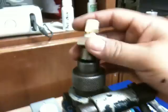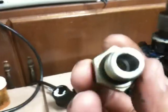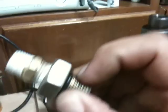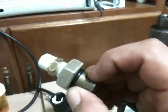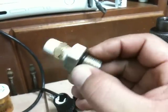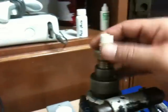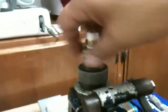One thing about this bolt — it's been bored out, and there's a little lip done by my friend Rudy Rapatas. He has a lathe and a milling machine and we like to dabble with this kind of stuff. We basically put an o-ring over this part on the inside of the threads of the bolt. What that does is it also seals up the air underneath the bolt, so when you screw this in, it makes it airtight. You can feel the o-ring tightening there.